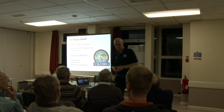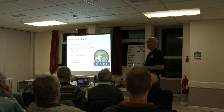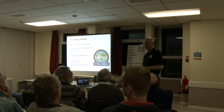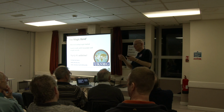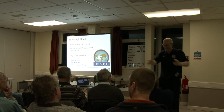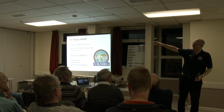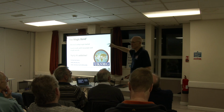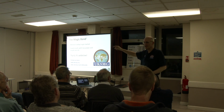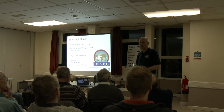My experience of these is you've got to be quick. Or sometimes just patient. I've seen spots where I've had to wait listening for half an hour for the opening to begin. The thing is that you could be with your dipole and your 100 watts here, and some bloke over there, 10 miles away, could have a much bigger station, but you can hear it and he can't. And that's the nature of sporadic E. You've got to be in the right place at the right time, and sometimes it's not the guy with the biggest station that gets through. But as you say, patience, yes.